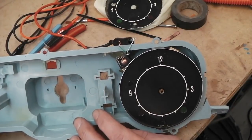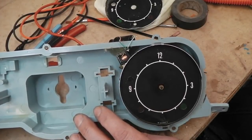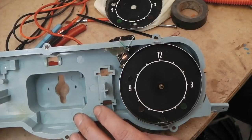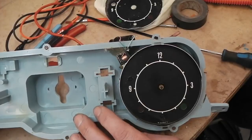Not as reliable in terms of it breaking, because you could get a relay fail, a fuse blow, a wire come off. But on a mechanical fan, you're normally pretty good. I've never known one really break. So this gives us that extra little bit of confidence, especially if we fit the sensor to the fan itself.